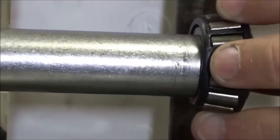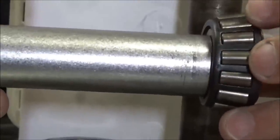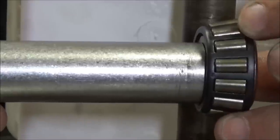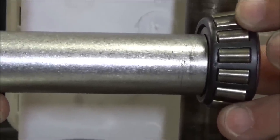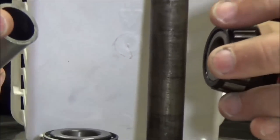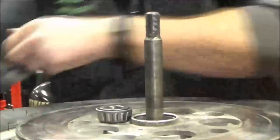As we tighten it down, that gap probably has the ability to be stronger than this thin metal cage. What's that going to do to the bearing in relationship to the race? It's going to immediately put a side load on it. The bearing is just not going to sit in there the way it's designed, it's not going to last as long. I can't tell you exactly how long, but it's just not right. We need two good machine surfaces.